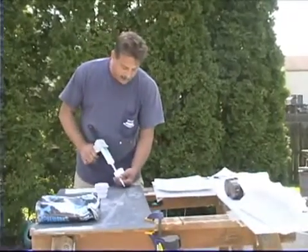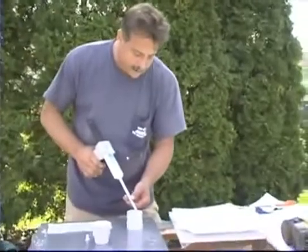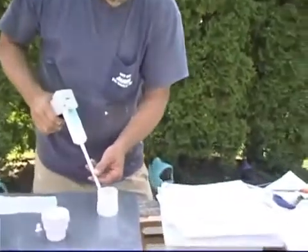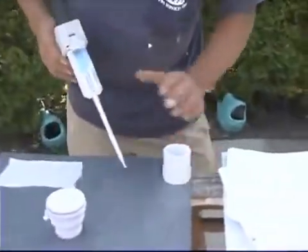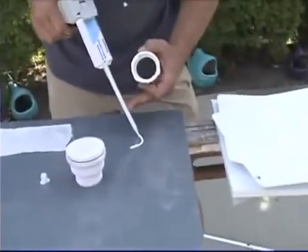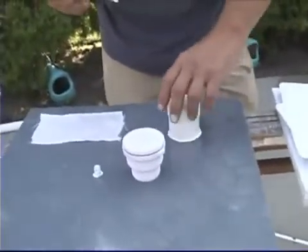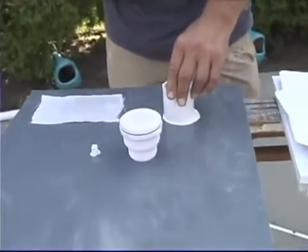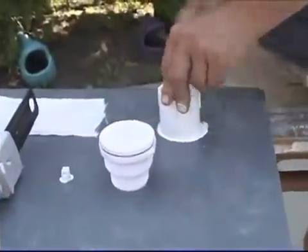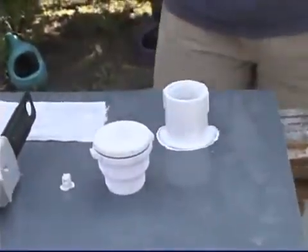So how we're going to conduct a repair like this — it's as simple as this: you can do this underwater. Lay your part and you're just going to shoot a bead of the material around the bottom. If you have the female hole left where you took the hydrostatic valve out, shoot a bead around on the bottom. Take that fitting and set it in right on top of where the hydrostatic valve fits. At that time you can take your fingers, swipe it around, and bond it if you can reach it in there. Leave it set for 20 minutes.